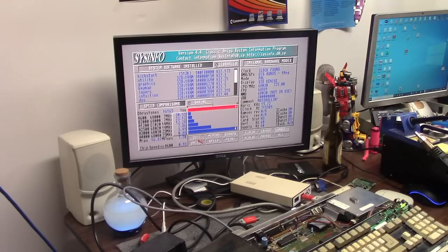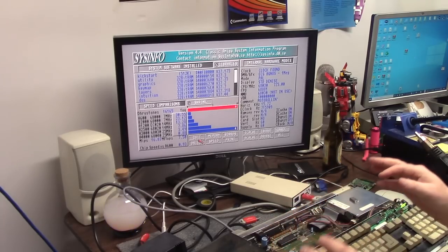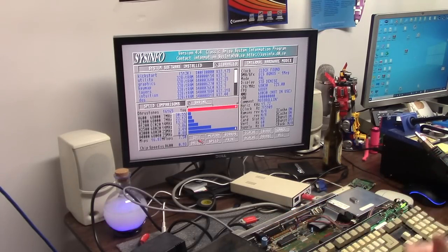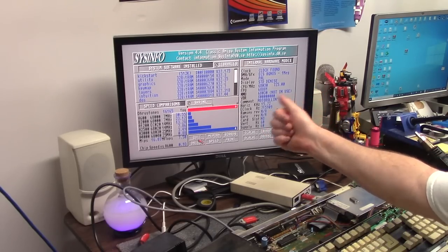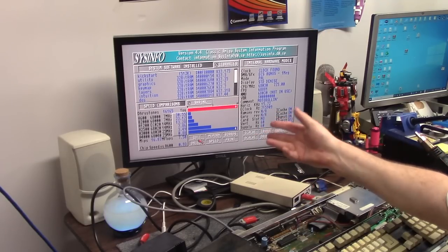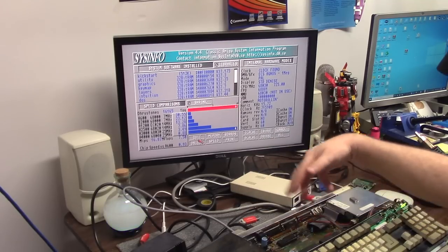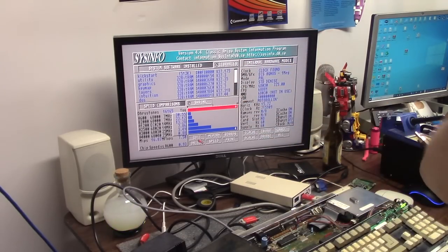I changed one file to make it an 030. And if I had a hard drive on here, it would use it. I could be real Amiga still, 030 emulated everything, replacing the CPU. Or you can roll full RTG. Shoot, add another HDMI port on here, some kind of switch box like the Vampire uses. Switch box it between this and that, and magic. It's up to you what you want to do.